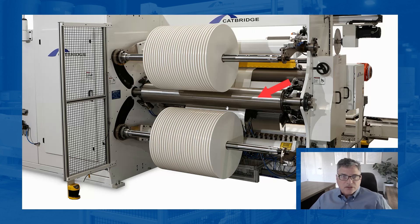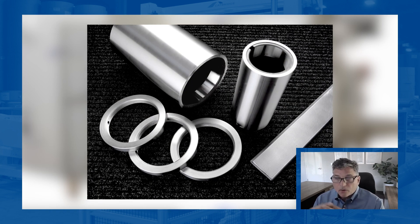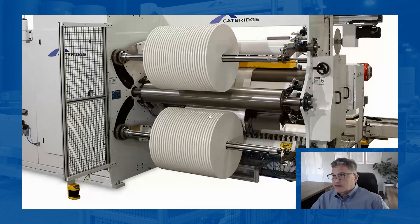This is a hardened roll. It's typically around 63, maybe 65 Rockwell hardness — somewhere in that range. When we make these rollers, they're through hardened, designed so that you can grind them and have new life when that time arises. They're so hard that these sleeves, if you dropped them, they would shatter almost like dropping glass. They're packed on a roller and held on tight with nuts on either end, creating a hardened roll that the blade is going to cut up against.